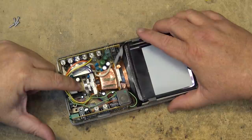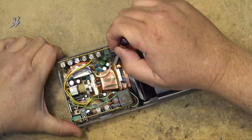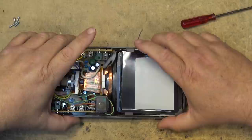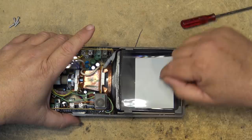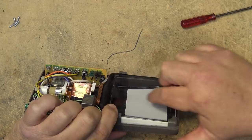At this end we've got the electron gun, and here's our little high voltage generator. These tubes do have a second anode, and it's connected right here — this is where that little cap goes for the high voltage. I believe on the smaller tube it fed through the socket, but they do still have a second anode on this thing, and the second anode is actually behind the screen itself. You can see the curvature of the screen in behind here.